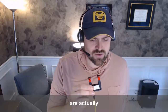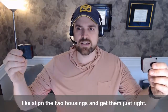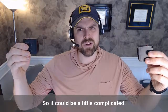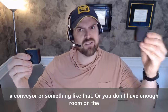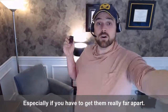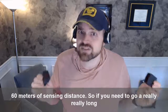But most through-beams are typically sold as two separate housings, so you have to actually align the two housings and get them just right. It can be a little complicated — maybe you don't have power on one side of a conveyor, or you don't have enough room on the other side. So sometimes through-beams can be a little challenging on the electrical or the mounting side, especially if you have to get them really far apart. What is nice about through-beams is there are versions with 50 or 60 meters of sensing distance.